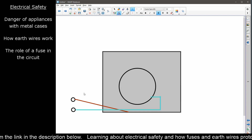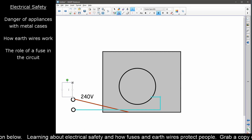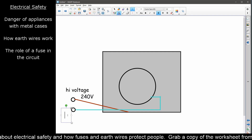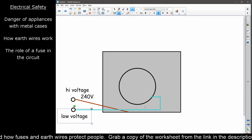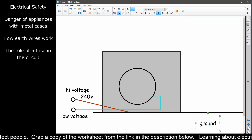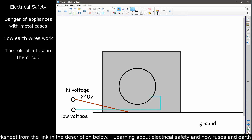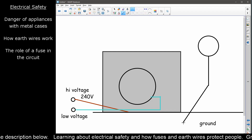What's worse news is that this is still the 240-volt side of things — and that's still true. Electricity will travel from areas of high voltage, or high potential as it's sometimes known, to areas of low voltage. Normally that's our neutral wire, but it can't get there because it's no longer connected. Other things that have low voltage include the ground. However, because most of these appliances are up on insulating pads, electricity doesn't travel straight to the ground — it can't.